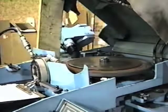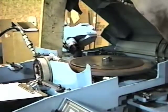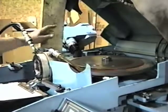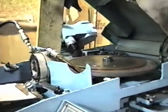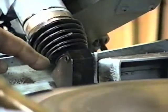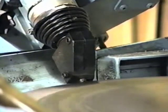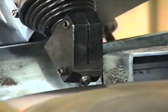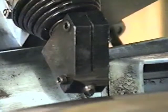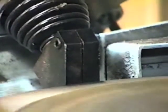I've got the wheel and stone back on the machine. I'm powering up the machine, and for demonstration purposes I'm just going to hit machine start. I've engaged the electrical and the hydraulics. This very large mechanism here is the dresser — all the work is done at the focal point. I'm going to push manual dress so you can see the diamond sticking out of the diamond holder. I'm going to engage the hydraulics again and it backed out of the way.